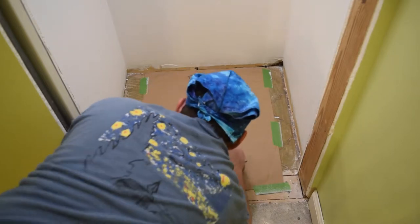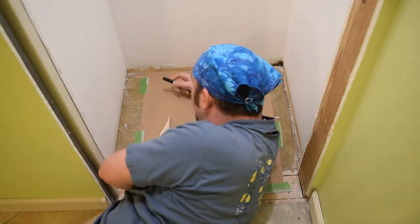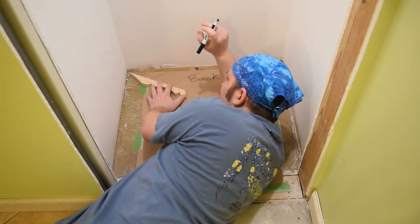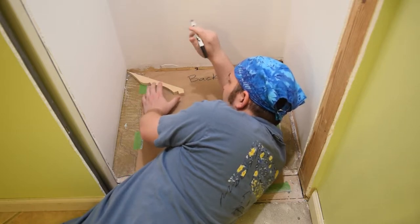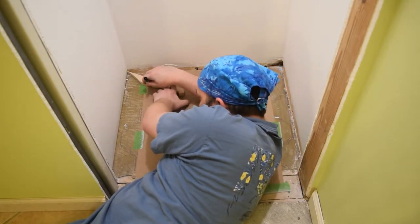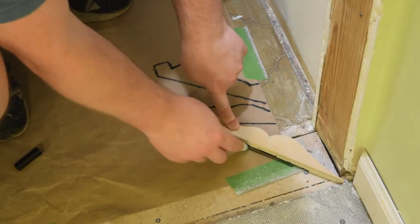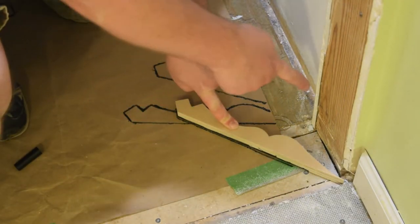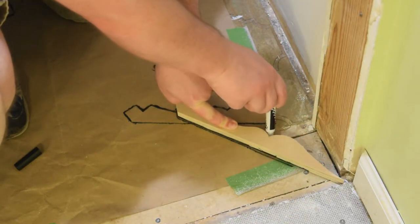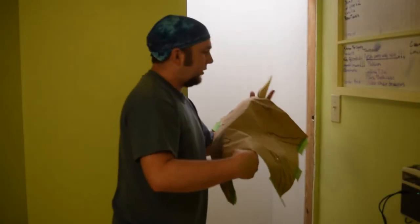So this is what a ticking stick can do for me. I got a piece of paper taped down, smaller than the overall size. I take the ticking stick, put the tip right in the corner, and then just trace the outline. I repeat the process, moving around the shape — marking this inside corner, this outside corner, and now this corner. Now I'm ready to go back down to the shop to mark this out on the concrete board.